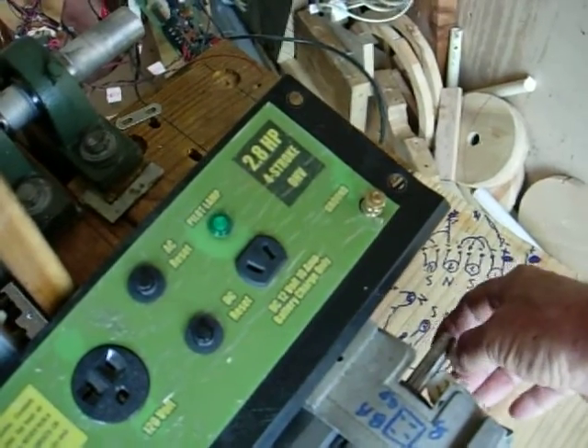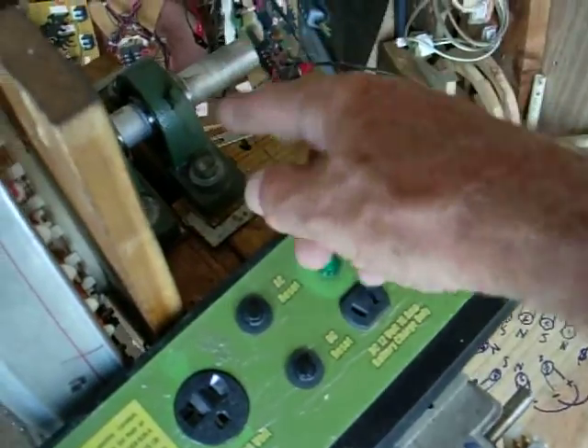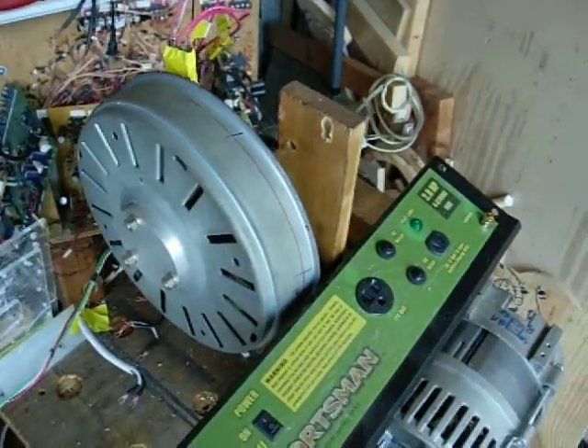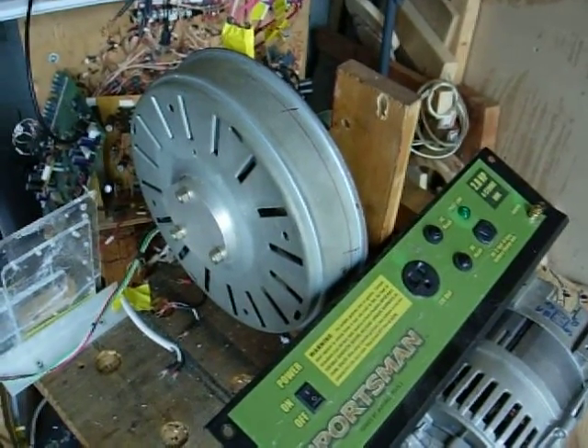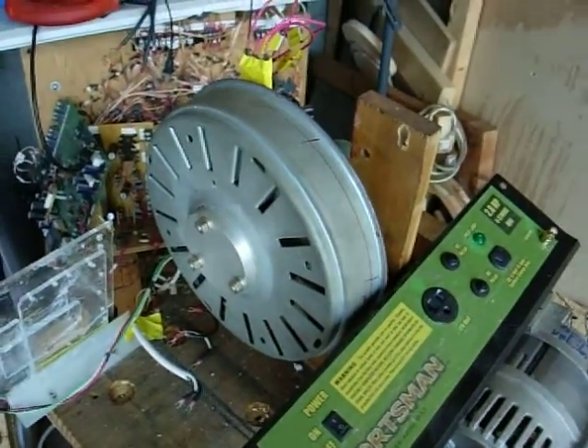That shaft will adapt the half-inch pulley here — about a two-inch pulley — and then a six-inch pulley up on the one-inch shaft up here. We'll start there and see if we can get 120 volts running a light bulb, and then we're going to have some fun when I get the pole transformers. We're basically there.